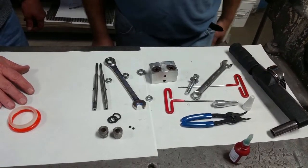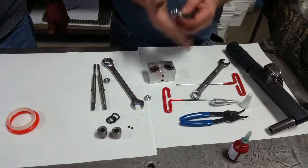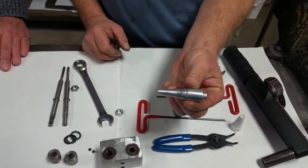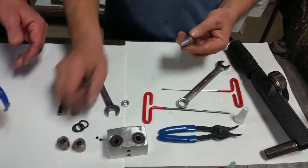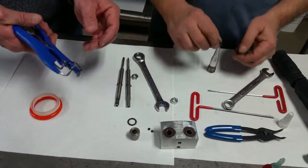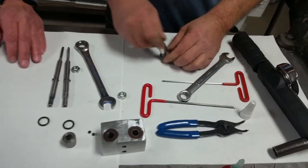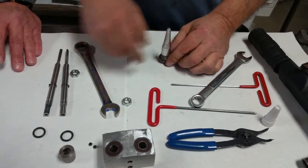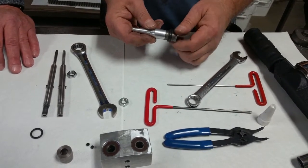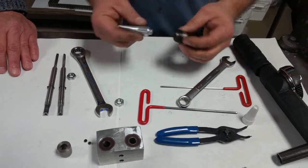Now Dale's going to go ahead and put the O-rings on his pulley. We've got a little jig made we use to put the O-rings on there. You can also use these pliers right here to put them O-rings on there — if it's already on the shaft, sometimes these pliers are really handy. If you don't know what these pliers are, get a hillbilly country boy from your bakery and he can tell you exactly what them pliers is for. You want to seat your O-rings. We've experimented over the years with several different kinds of O-ring material and we always come back to that Buna — they seem to last the longest. They've got a little more stretch, they're a little more forgiving, and they don't dry out so bad.